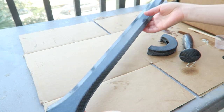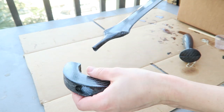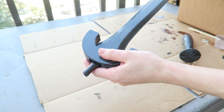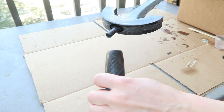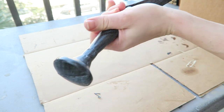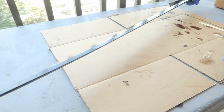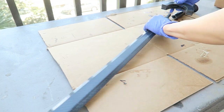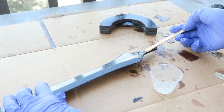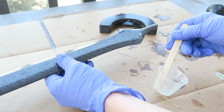Because I used the dowel rod on the original 3D printed part to also cast this extension at the bottom of the blade, that does make it a lot easier to join all of these parts together once they're trimmed to fit properly. So we can do a rough test here and they already stay together okay. Now it's time to join them permanently using a fast-setting epoxy. I apply this generously to all the parts on the inside where it's not going to show, but it will ensure that they're adhered together, all three parts to each other.